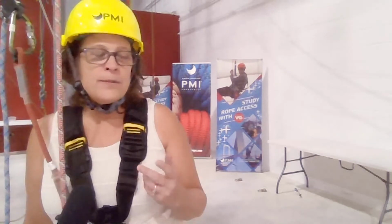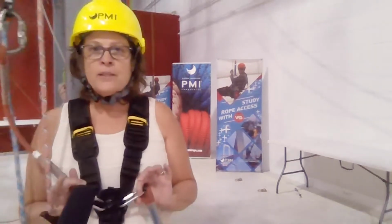Why on earth would a statement like that be in the standard? Well, I'll tell you. This paragraph was written specifically to address a couple of requirements that are actually found in OSHA regulation. Specifically, OSHA has, as you probably know, two segments: General Industry 1910 and Construction 1926. 1910.140(c)(10) and 1926.502(d)(6) both say essentially the same thing, and that is that two connectors are not permitted to be attached to the same D-ring at the same time.